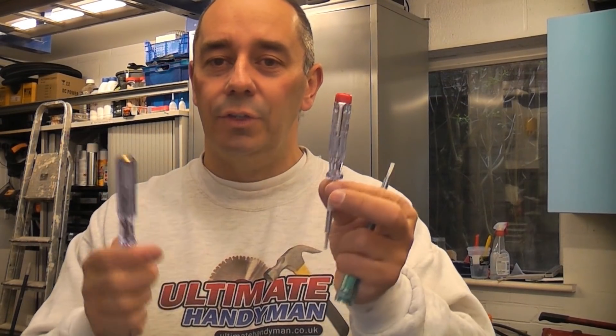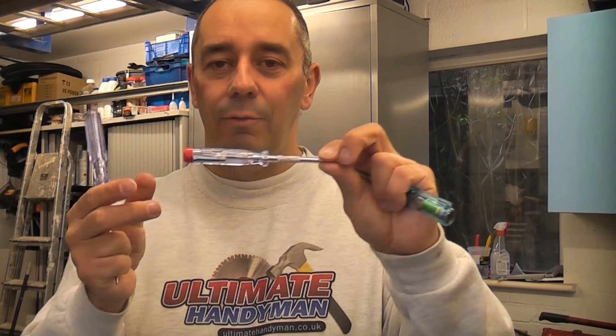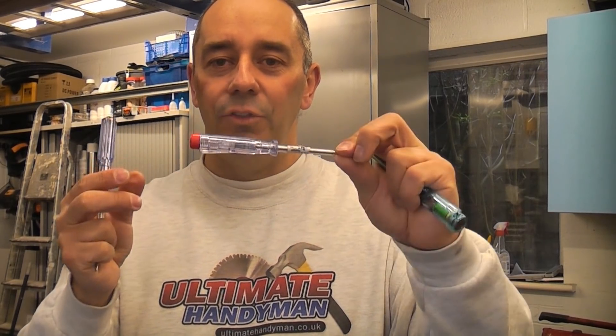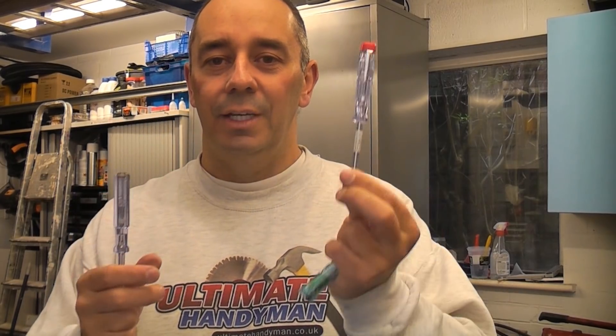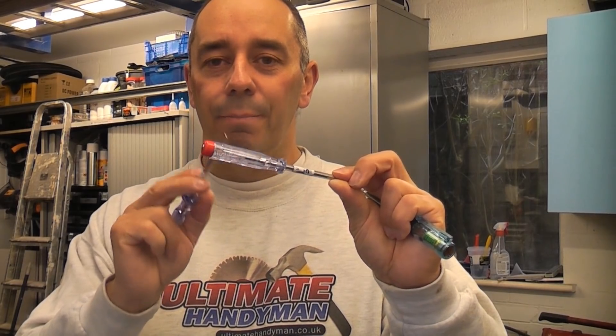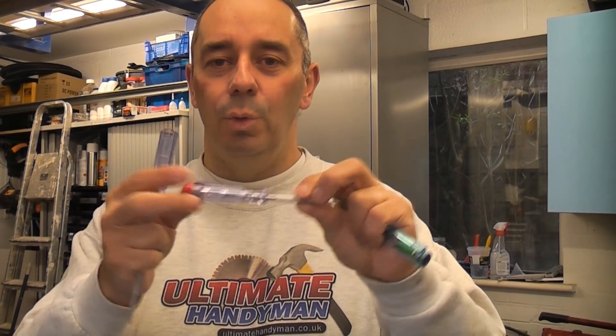You do have to be careful — you can get some of these that are 12 volts and not 240 volts. I do know somebody that once got a 12-volt one and tested it on a 230-volt supply and it did go with a bang. He did not get injured; all he needed was a clean pair of underpants. The screwdriver actually did what it was supposed to do — there's an internal fuse or resistor in there that blew and it didn't actually injure him whatsoever.